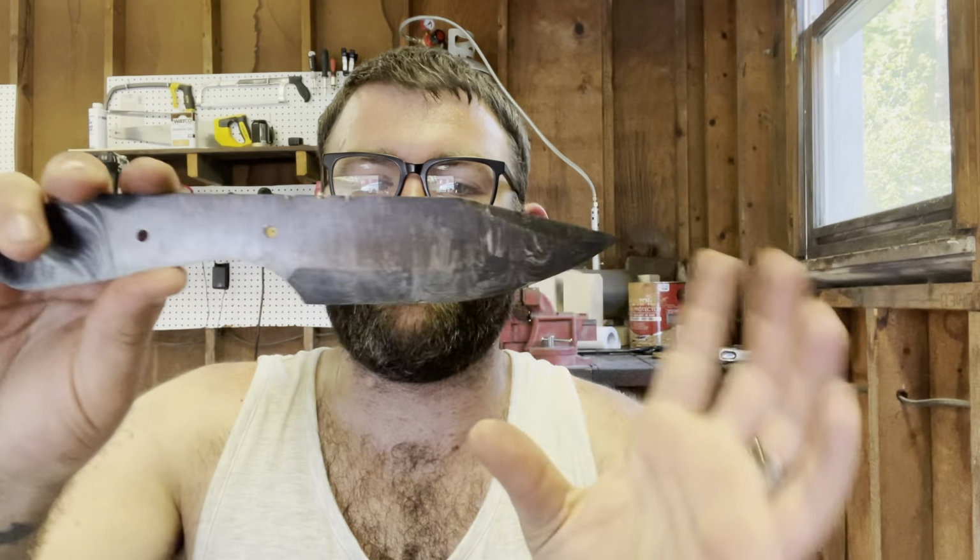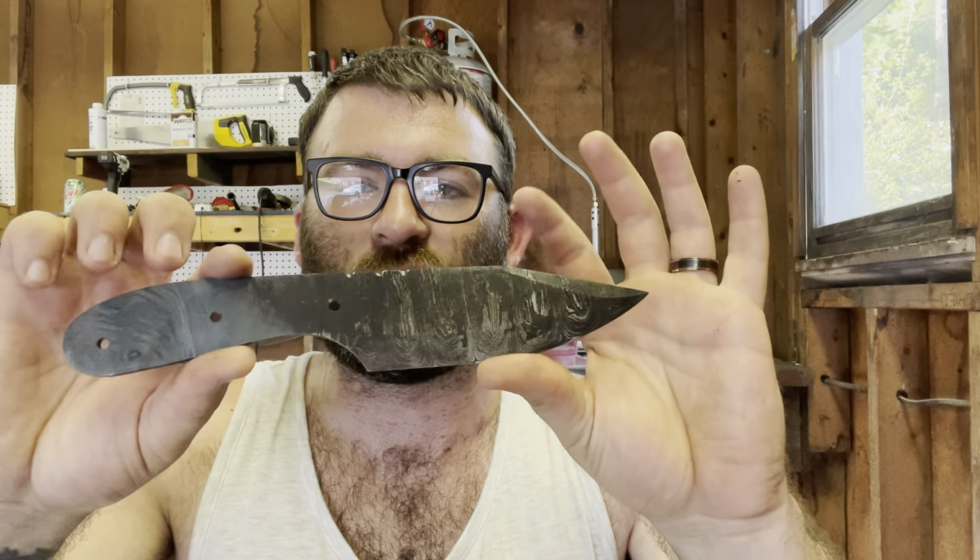It's hard. Hard as glass. Now this is 1095 and 15N20. I know I didn't say that in the beginning of the video, but both nice high carbon steels, really commonly used for Damascus. Skates that file. Let's get it in the temper cycle. 350 degrees for, let's say, an hour and a half.